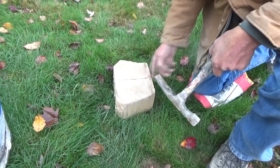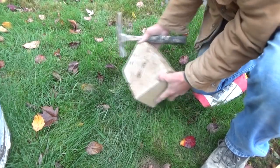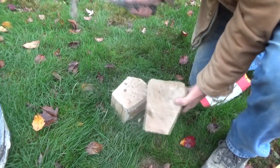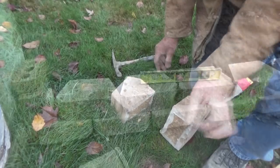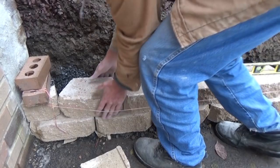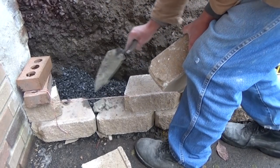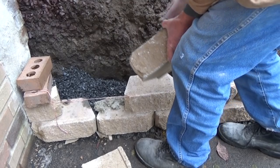The reason I didn't bring my big saw is if I plug it in sometimes it will blow the circuit and there's nobody home. There you go — that's all you got to do. After I get my first course in, just to tweak it a little bit, sometimes I just put a dab of cement in there to make sure it's going right even with the line.